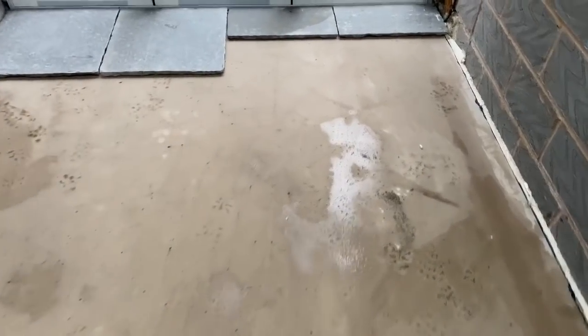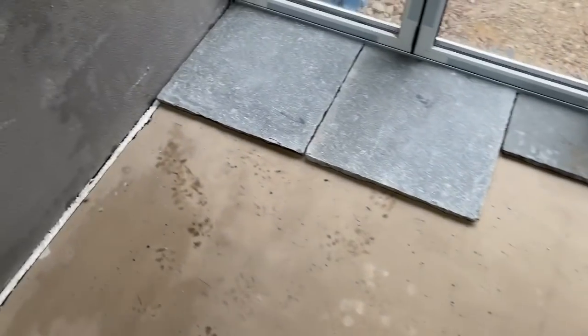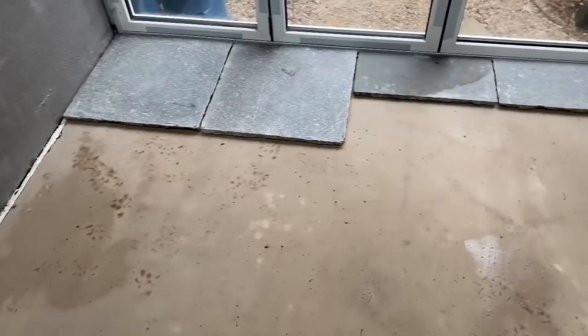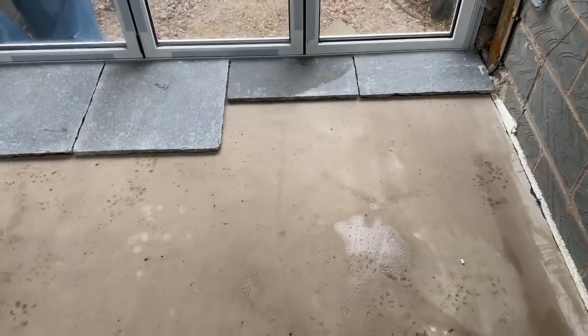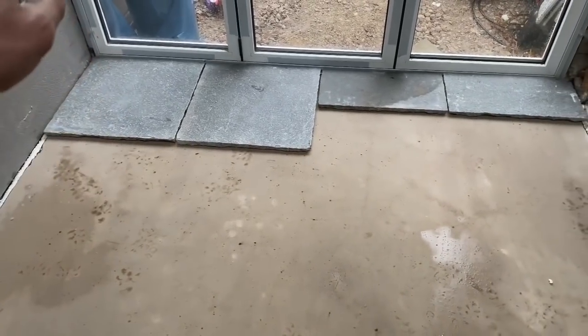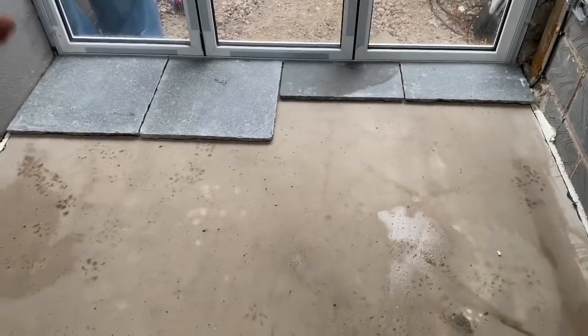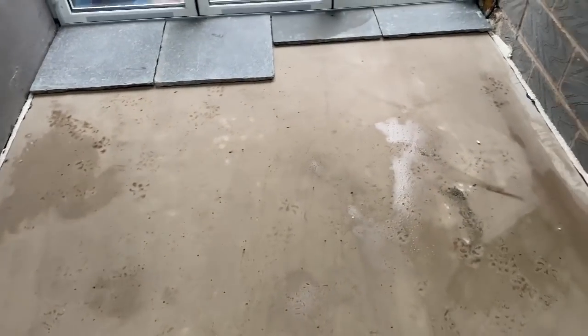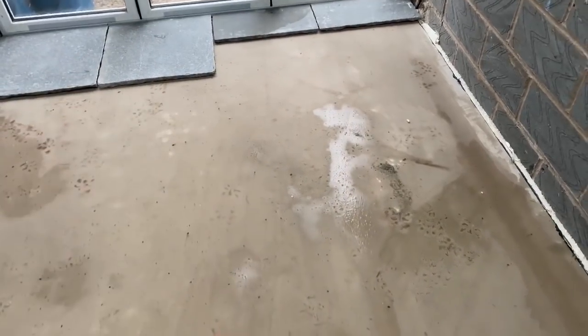Just dry coursing this out, and I tell you what, doesn't happen like that much, does it? It's going to fit perfectly. 8 foot. We've got the skirts to go on as well, and the plasterboard, so no problem there. Nice and straightforward, really. Just need to find our height off that floor through round to here. I'm going to start with the thickest flag on this side, because I know if I can get the thickest one down, all the rest will go down as well. But if you start with the thinner one and then get onto thicker ones when you're down here, you're in trouble.